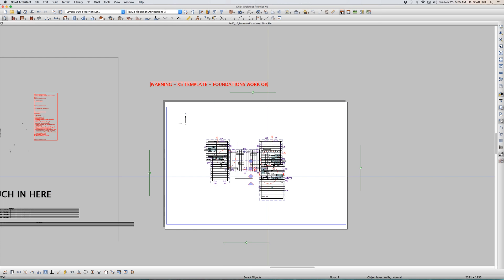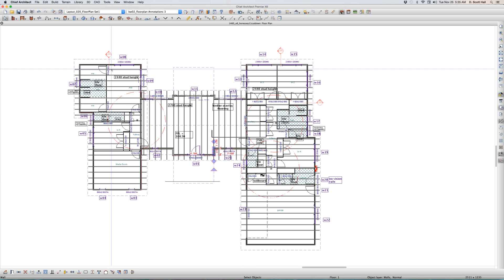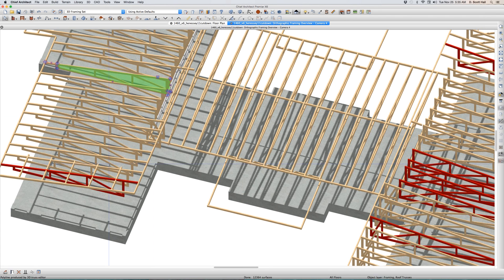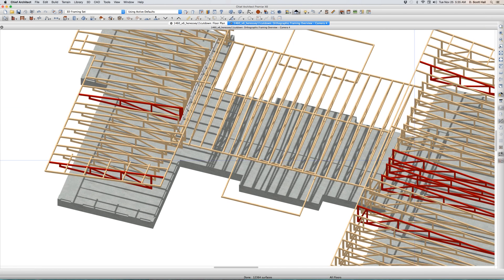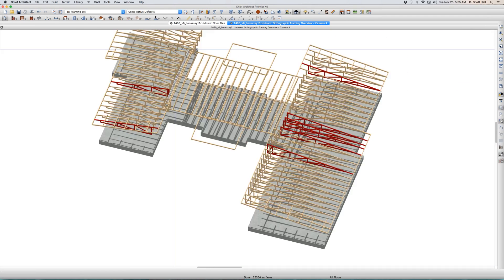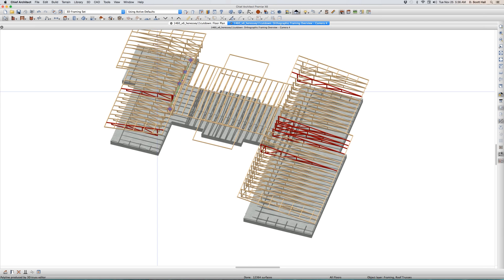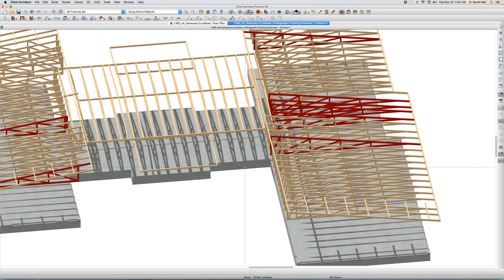Anyway, I'd like to know that and I can't figure out the truss issue right now. So to review it quickly — HF — I think Bernie, your problem was the truss stretched all the way through these other roof planes and went over to here. The way you stop that is you build this truss first — you build the truss in the center first and end up putting a girder truss right there that stops the trusses from going on through.